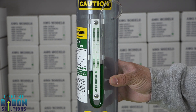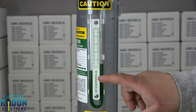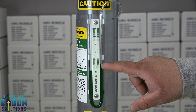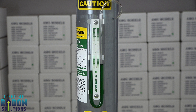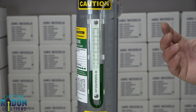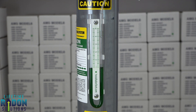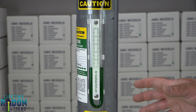So this is your manometer. One thing you want to check first is that the fan is plugged in. You can see the mineral oil here is offset — it's pulling half an inch of water column. What that means is it's pulling enough negative pressure to lift water about a half inch up. So it's pulling good negative pressure and moving air volume, which is what this fan is designed to do. If I unplug it, you can see how it zeroes out.